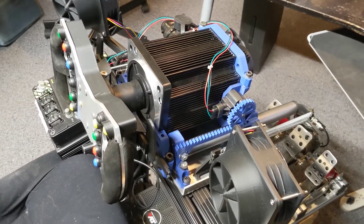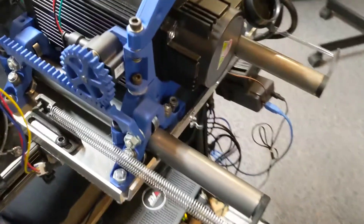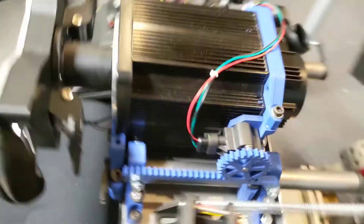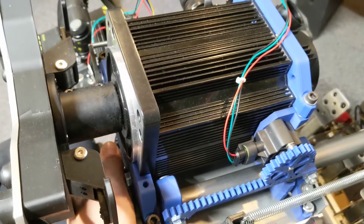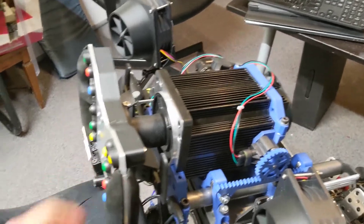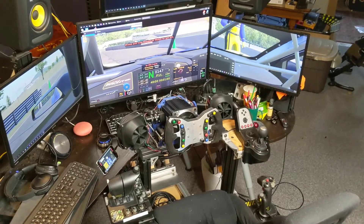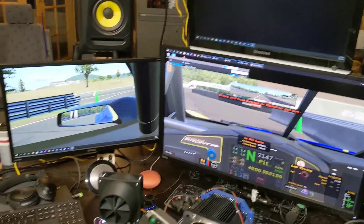The other piece I just recently made was this yoke slider. It's something I designed and it's mostly 3D printed, and uses just regular cheap 608 bearings on a 1-inch tube. If I loosen this off and unlock it, it allows me to use it as a yoke for flight simulators. I find I like the yoke better than using the stick — it's more like flying a small plane. With it rolled into position it sits up just kind of tucked up, hanging over the desk a little bit, so I can get it close to the monitors and still have some desk space when I'm using it for work.